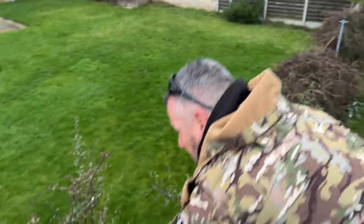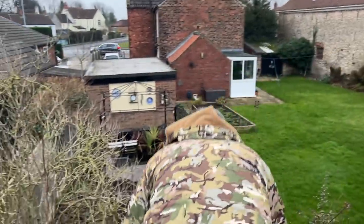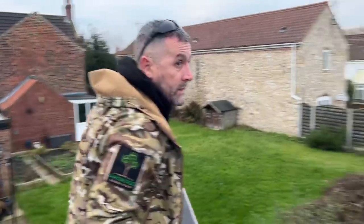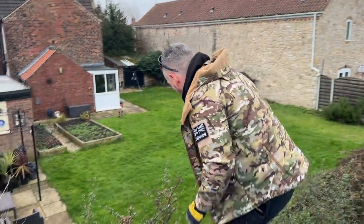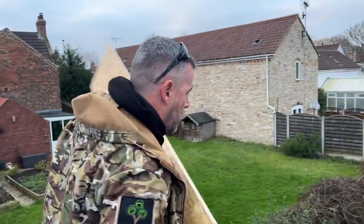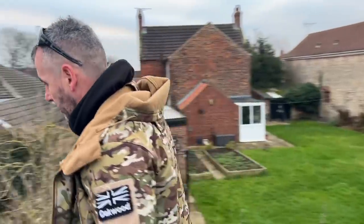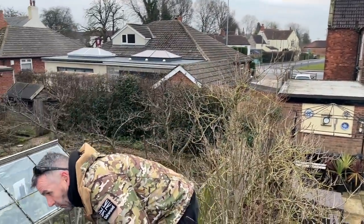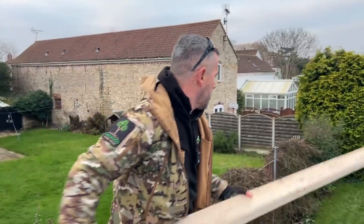So what we'll do first, I'm going to clear off this roof. We put these bits and bobs on to weigh it down because we obviously don't want the rubber — the roof getting wet — so the plastic blowing off over the weekend. But it's been alright. I'll strip this off now and then we'll start sanding it and I'll explain why you need to sand it and to what grade you need to sand it down to, so that you get a good fix on your rubber. It needs to be nice and smooth and dust free, and we're using a blower — or I'll just use a sweeping brush on that as well.